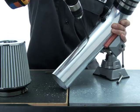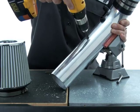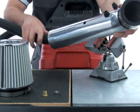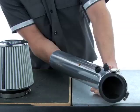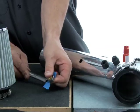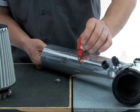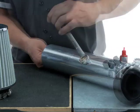With that said, drill a 7/16 inch hole into the inlet duct while it's removed from the vehicle. Clean out any shavings with air or a vacuum and make sure the edges are smooth. Slide the collar in place from inside the tube, and then hold the collar with a tool from the inside as you tighten the nut from the outside.